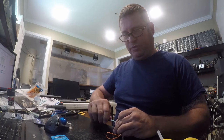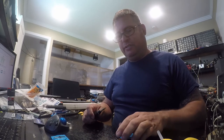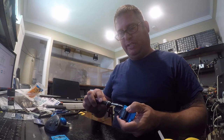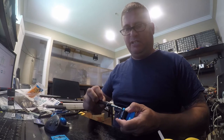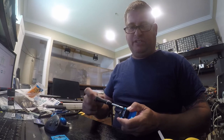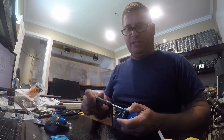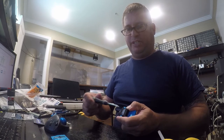And I believe this is really the best way to use 3D printing, where you're putting a wood screw into it and it lets it cut threads in. I've seen a bunch of other ways to secure things to 3D prints, and I'm not 100% sure those are always such a great idea.